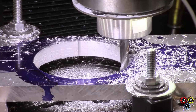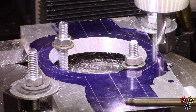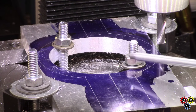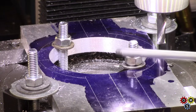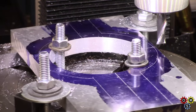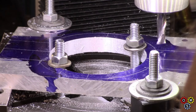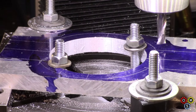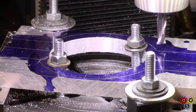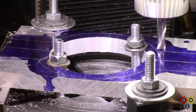That's enough of that - let's finish going round that and we'll check it again. Clamping is still a bit of an issue because I don't trust just these two clamps, which I've had to move out slightly. Having got the centre clear, I've just put a couple of bolts in to nip the inside. I think it's going to work, assuming I've got enough depth - I might just about do it. I need shorter bolts - these are two inch, I may have to get some one and a halves.